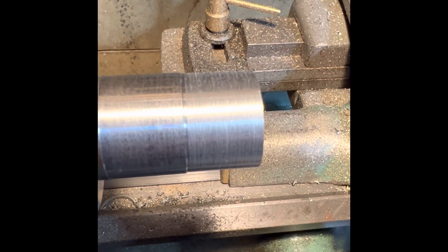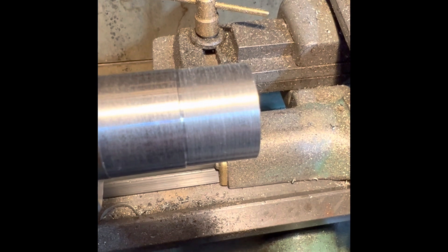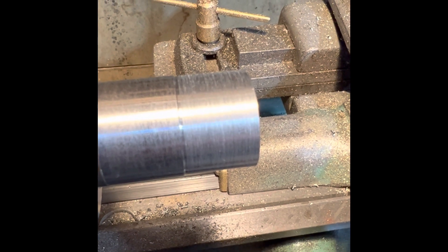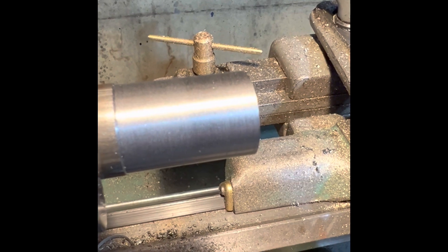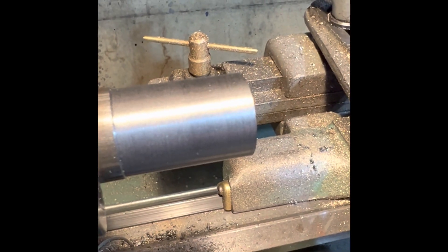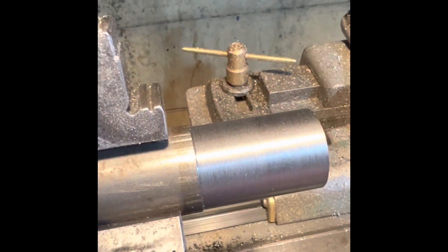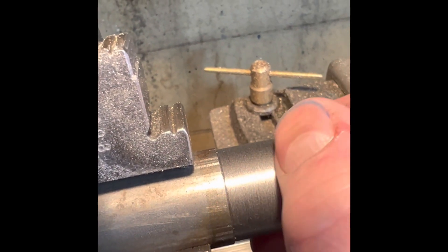I'm just playing with this, literally, just to find out what lead alloy does — what this combination of steel does and how machinable it is, just so I can play around with it at some point. You can see where the 5th thou cut went to a 10th thou cut. Kind of interesting. The 5th thou is looking pretty nice; the 10th thou is okay, but just a little bit rougher.